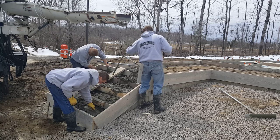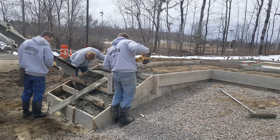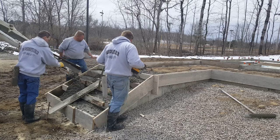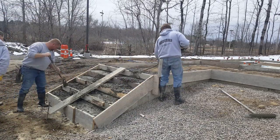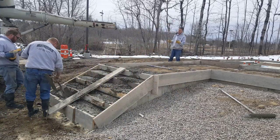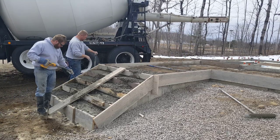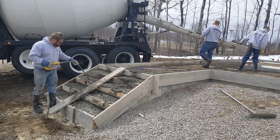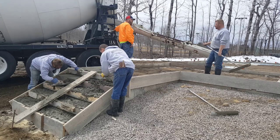As you can see, we're pouring the concrete in those stairs first, and we usually put it in there pretty dry. We don't want it to sag too much. We'll vibrate it quite a bit so it will vibrate all the little air pockets out. That way when we go to finish these stairs, we're going to strip all those boards off and we'll rub it all down with a sponge so they come out really nice. Hang out for the end of the video so you can see just how nice those stairs come out.